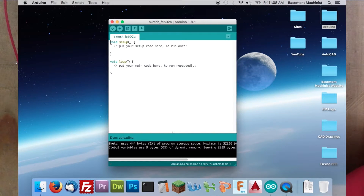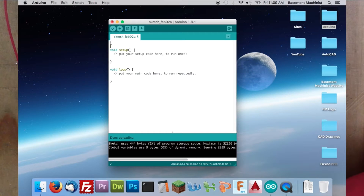You've got to keep in mind that the ATmega chip in the Arduino doesn't have a whole lot of memory for storage, so you need to keep your programs as small as possible. Typically when you're writing a program you can do everything in the loop function. However, with the engine I'm building I'm planning on using two solenoids — so inside the loop I would have to write a program for one solenoid and then write the exact same program again for the second solenoid with a few variable changes. That's going to make the program quite lengthy. So in order to make it as small as possible, we're going to use a class.